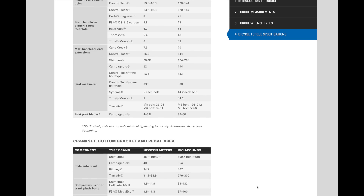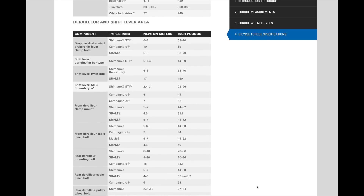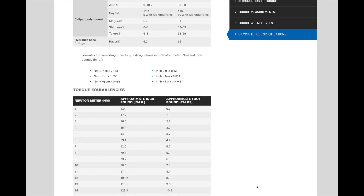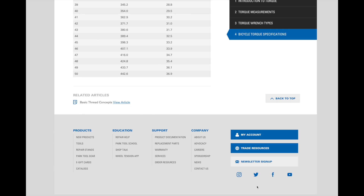Going back to putting some grease on the bolts — sometimes if you are torquing a bolt that's totally dry, it may give you an inaccurate reading where you may get a torque reading that's high but the bolt itself isn't really actually tight. Putting some grease, oil, or some kind of lubricant allows the bolt to get up to full torque, and it makes them easy to remove later as well.